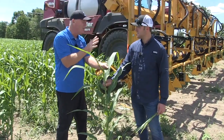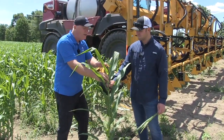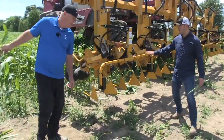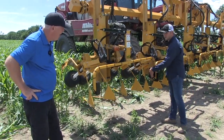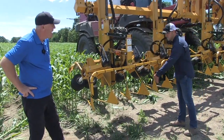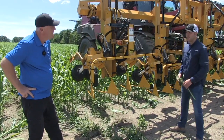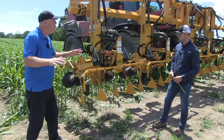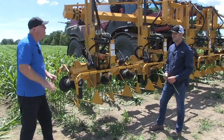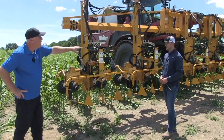This year we're dry in Ontario — fields are more variable than we'd like them. How do you keep this machine adjusting for a variable field? Here we have the row unit; there's two rows that are actuated together, and we have electronic eyes that help adjust for height differences. There are two sensors: the top of the plant stays between the top and bottom sensor. If both sensors are covered, it'll raise; if neither are covered, it'll lower. That aids in doing a good job with variable fields — there'd be no way you could adjust the header yourself, so you've got to rely on this automatic system to do a good job of pulling the tassel.